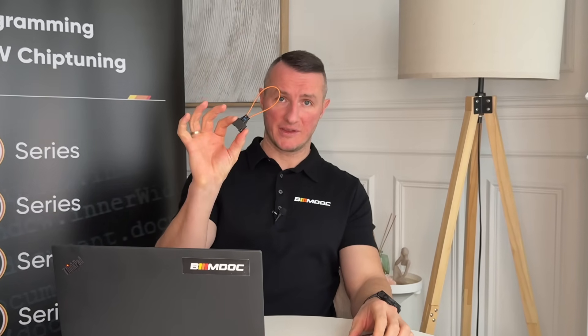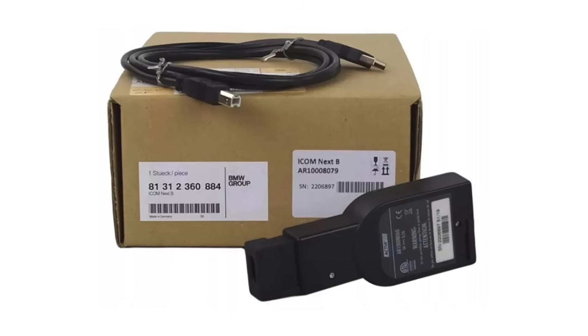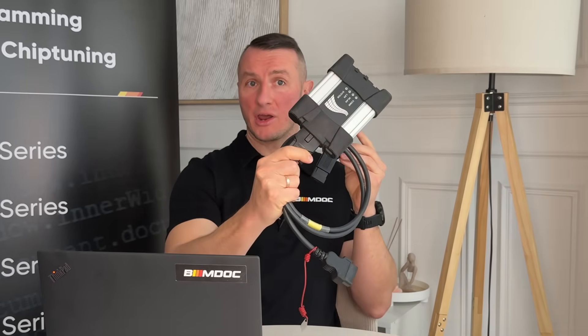This is the story of one of my subscribers, and it's a very good story everybody has to learn from. By the way, if you have any similar stories, feel free to send me photos or videos with a short description. To program the head unit of E-series which has the MOST bus, you require ICOM-B. You connect ICOM-B to the regular ICOM — called ICOM-A — through a USB cable, and then connect that tool to the fiber optics of the BMW itself. Only on E-series; on F and G it's not required.